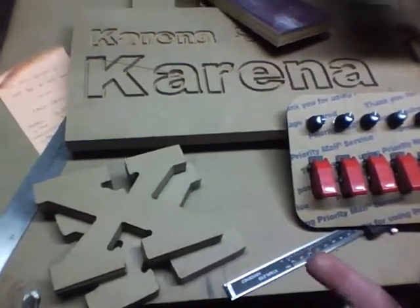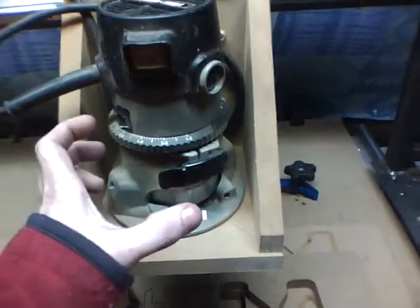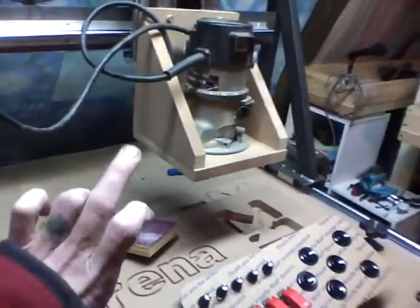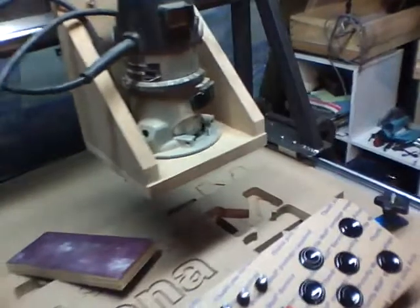I know a lot of people have bad things to say about LazyCam, but it's so straightforward and simple, and I figured it out, which counts for a lot in my book. Everything here was laid out in LazyCam, or it was done in SketchUp and then brought to LazyCam, or done in Inkscape and then brought into LazyCam. It just works. The next thing I'm going to do is mill a proper clamp for the router. I can get rid of this big ugly box and this ugly base, and just do clamps around the barrel of the motor itself, the way it's supposed to be. When I figured this gantry height, it's actually figured for this motor to hang down about two inches lower than it is now, so that'll be nice to get fixed.